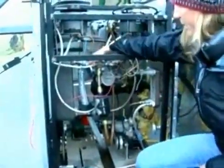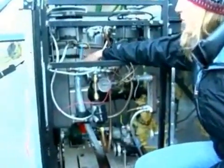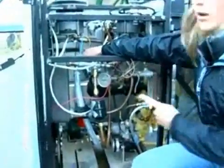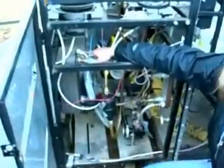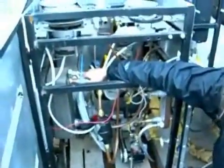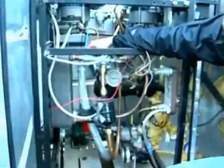The action starts here in the vaporizer, so I'll start there. The glycol comes into the vaporizer here from the ORC, where it absorbs all of the heat collected by around 20 square meters of collection area in the parabolas. It's heated up there and comes into the vaporizer here.